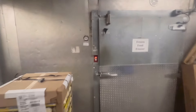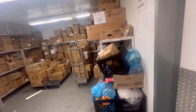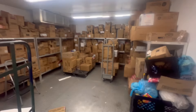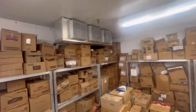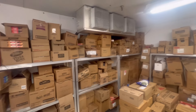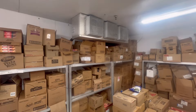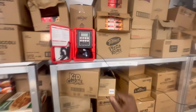I'm checking the discharge air temp right about now. But I want to think these boxes are an issue too, just up against the coil. You're not really going to get that air circulating on that backside of the coil either. I think that's just stacked up too high for me. Y'all let me know y'all's opinion. I think it's stacked up too high.